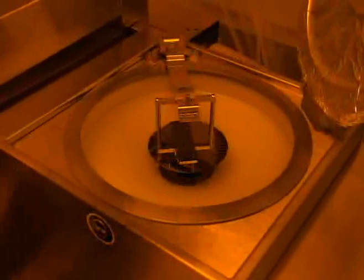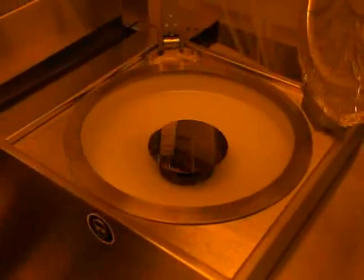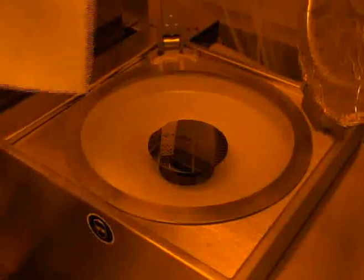At this position, the wafer is centered. Carefully raise the two rods and then the centering tool. Be careful when handling the centering tool — quickly dropping or bumping the tool can cause your wafer to break. At this point, you should line the bowl of the spinner with tex wipes to absorb the splashed photoresist.